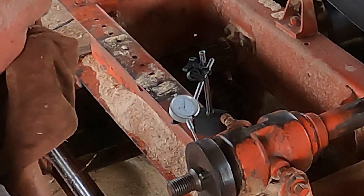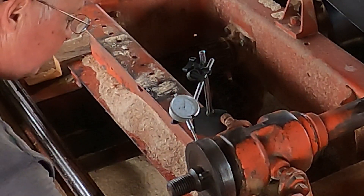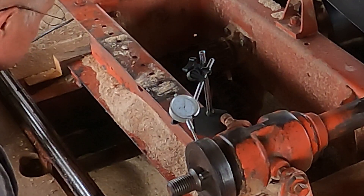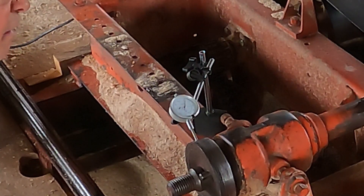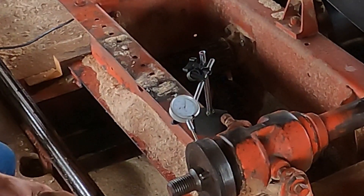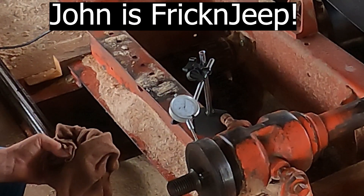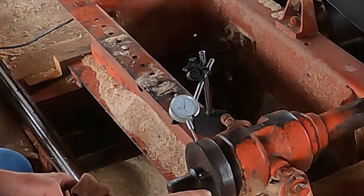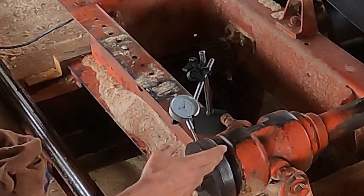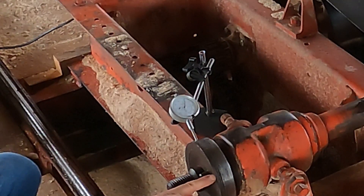I looked into what it takes to smooth it, make it perfect. There's a jig — I know more now — I can make a jig that mounts here and here, but this is tapered, so it's a little bit tricky. Let's measure it and see what it is. If it's three or four thousandths, John suggested we're probably not going to fix it easily because three or four times 56 inches ends up being a lot. The fix is to remachine this here on the machine, so somebody will come out to do that.